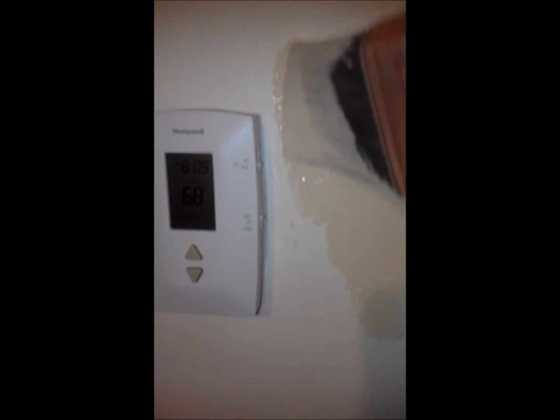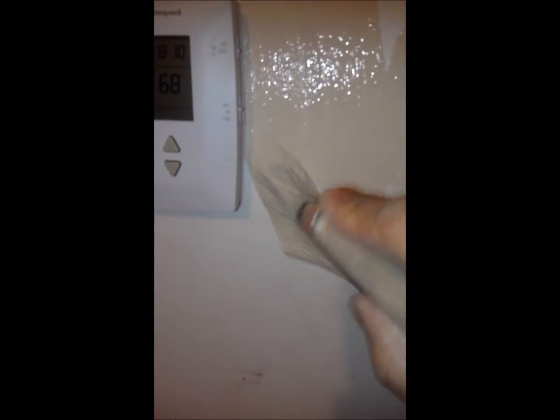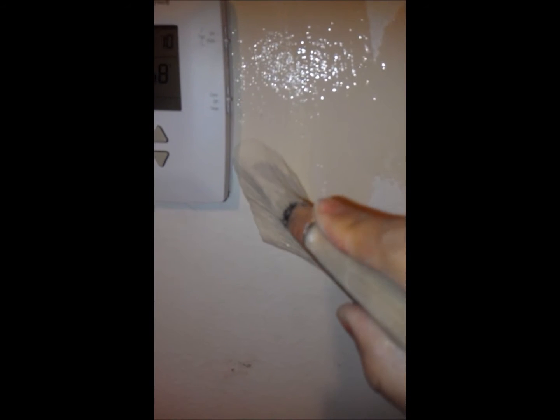Once you've got paint on the brush — this is a three-and-a-half inch sash brush — I like to paint to the side a little bit just to get a little of the material off, and then you just bring the edge into what you're doing. The edge of the bristle creates a little bead. If you bring that bead and press it to the side of what you're painting, you'll get it right on without having to use tape.